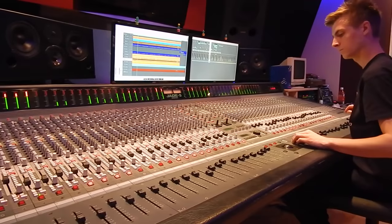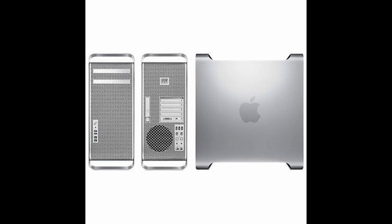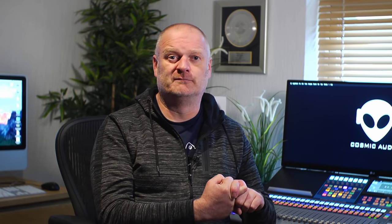The setup consisted of a large-format 48-channel analog mixing console connected to a Mac Pro. The Mac Pro had PCI slots, so we had a MOTU PCI card connected to MOTU's own 24 I/O breakout boxes, giving us 48 channels in and 48 channels out of the computer — easily expandable up to 96 inputs and outputs just by plugging in more expansion units. Super fast, super reliable, sounded great — a fantastic solution.